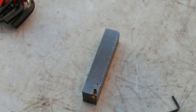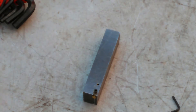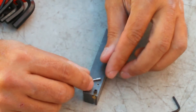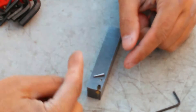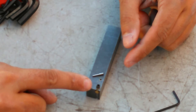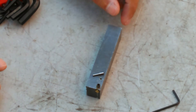These are jets, so they have to have a hole that's cross-drilled in them. Once I drill the hole, I register it with this little pin — I stick it through the hole so the piece is solid and can't twist or move. Then I cut the slot. The slot really has to be held firm, and having that second pin through the hole means it's just not going to move when you slot it. So right now I've tightened it down and I'm ready to put it in the machine.